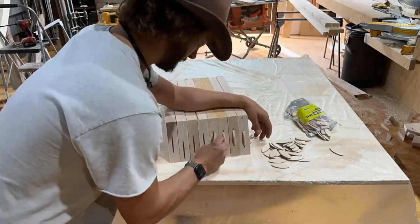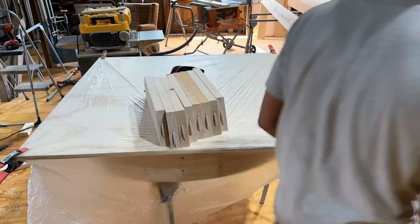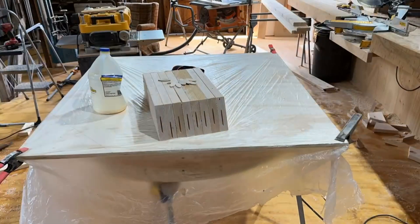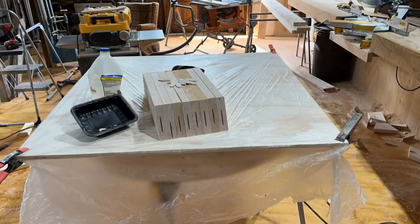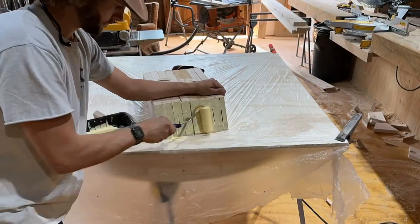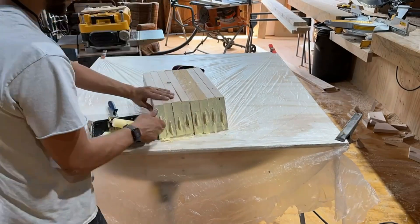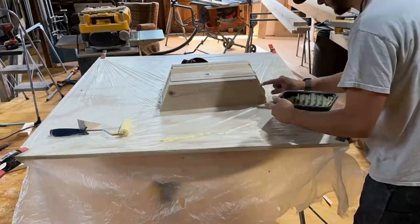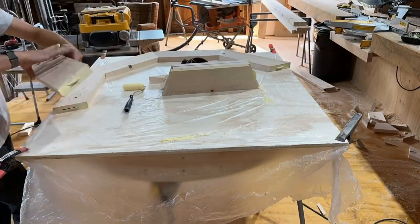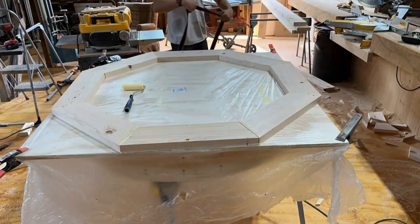To make our octagon, we cut eight pieces at tidy 22.5 degree angles, and we do our usual marking and prep for cutting the slots with the biscuit joiner. These slots receive a small oval-shaped biscuit of wood that helps keep everything aligned while we glue it up. Wood glue is cheap and peace of mind expensive, so we really slather the glue on and insert the biscuits to make sure we get healthy coverage in our glue joint. My preferred method of clamping these wooden rings is a simple ratchet strap wrapped around the outside and tightened, but not too much.